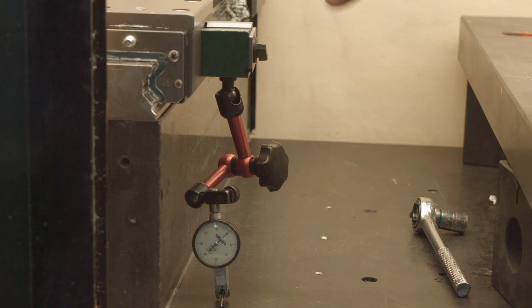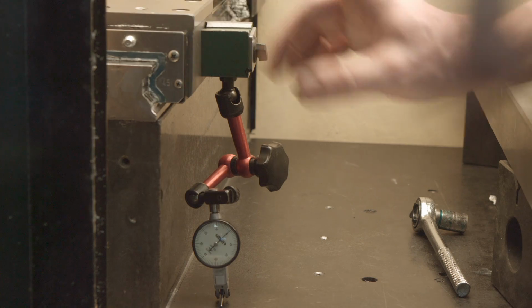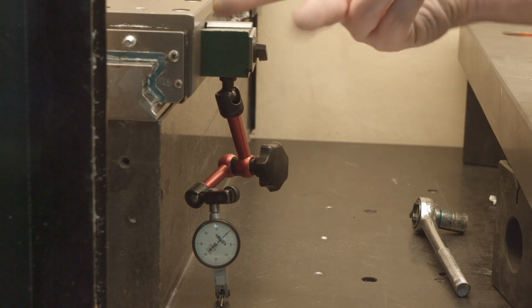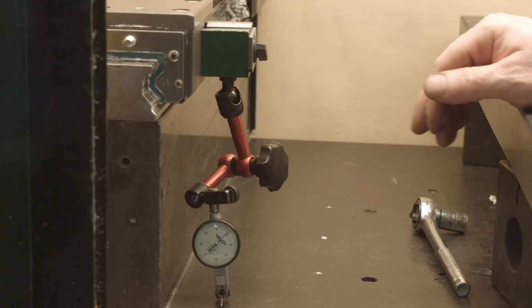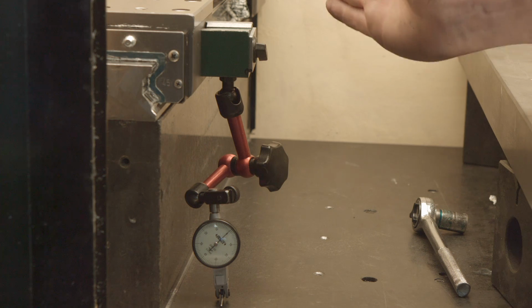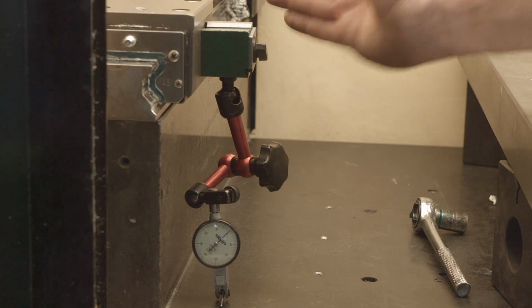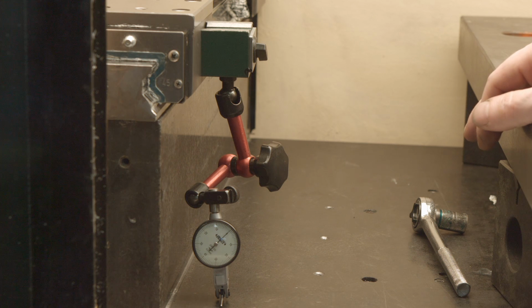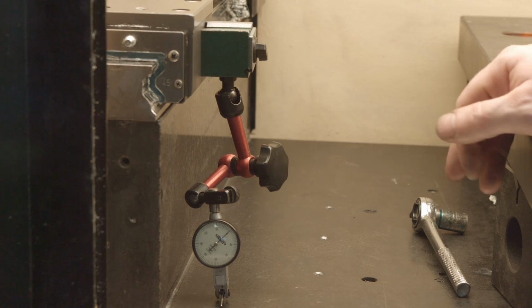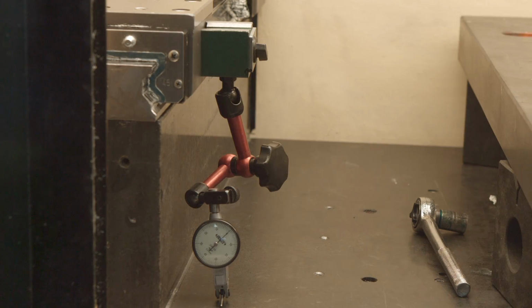So now I have to set the ball screw to run through with the rail. It's much easier because I have just those 4 screws, which is actually 2 points of contact, really, front and the back, so how hard can it be. I mean, obviously it's not that simple as it might seem, because you still have up, down, and wiggle that way. So that might take a bit of time, but I'm assuming that's gonna be way less time than I spent trying to make that thing straight, flat, and without the wobble.